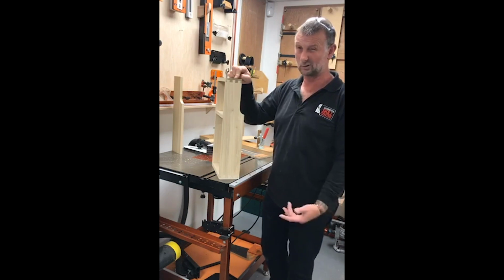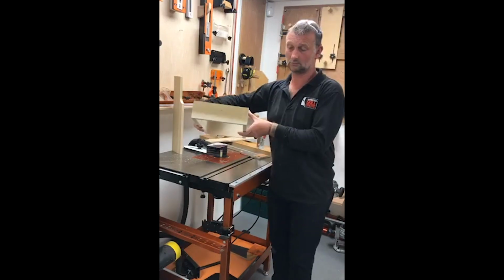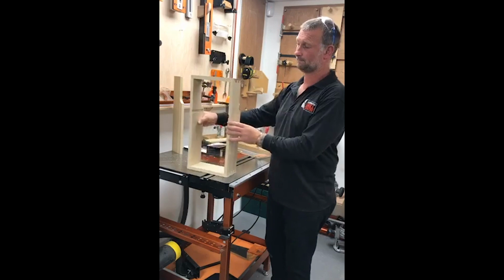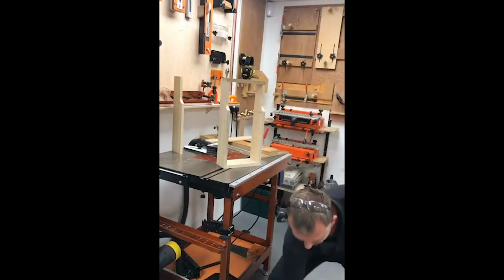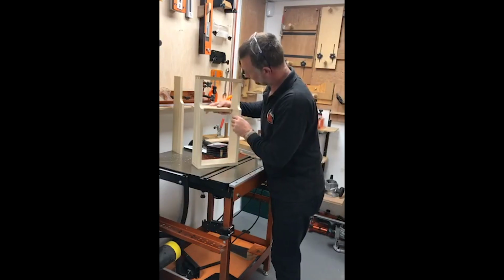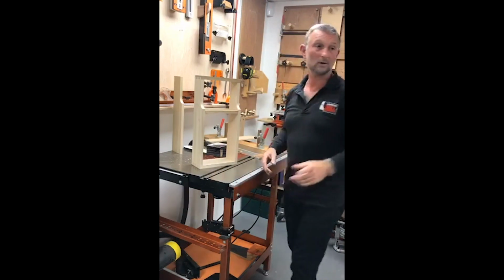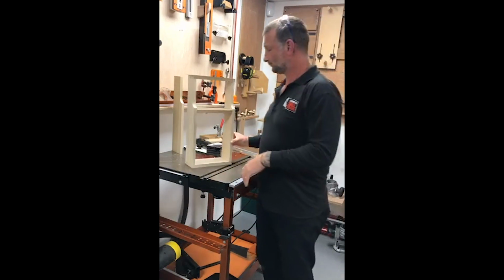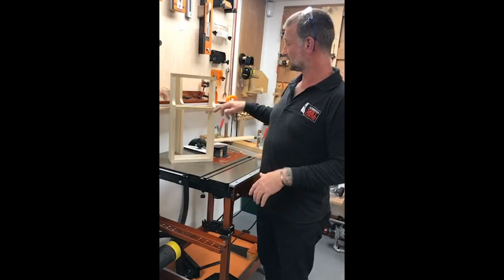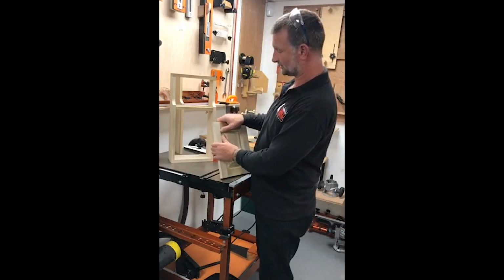So we'll get some jigs out and we'll do some dovetailing. Half blind dovetails these, so they're only visible from the one surface. Half blind. Right. Lapped dovetail, as some people call them. Alright, so after that, let's put that back in. Should have glued something. Oh, can you pass me the cabinet door? Alright, so cabinet sides, shelf groove, dovetail, and then we will finish up the session.